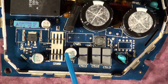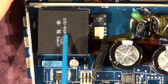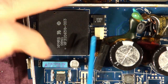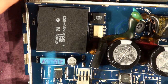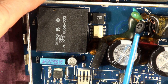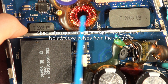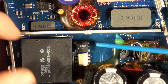You've got the transformers — very high quality, low-profile switch-mode switching transformers from Xformers in the USA. It's a custom Bose part number so you can't find it by searching, but I've never actually had one of these fail — they're very good quality components. There are two opto-isolators: one feeds back the normal DC voltage to regulate the power supply, and the other feeds back control pulses from the microprocessor from the low-voltage side to the high-voltage side. There is 2 kV isolation between these two sides.